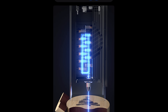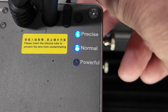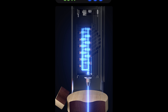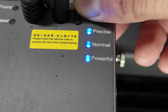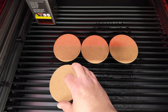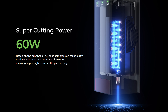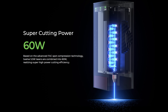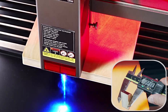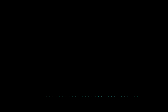Next is the 40 watt setting. It's great for a little bit thicker materials like acrylic, medium-density woods, and material that you may need a little more power to cut. Last is the 60 watt setting — if you're looking to cut thick materials or just quickly rip through those batch projects, this is the setting for you. It incorporates 12 five-and-a-half watt diode lasers, and Creality says it will cut through 22 millimeter basswood, 30 millimeter black acrylic, or 0.2 millimeter steel sheet all in one pass.